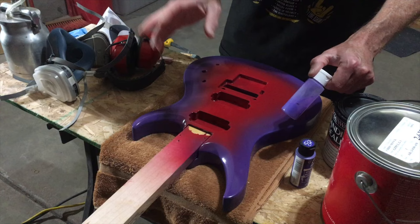Now, with Target Coatings EM6000, you can add a cross-linker that they sell, which basically turns it into a pre-cat lacquer so that it will cure more thoroughly and much harder and is much more resistant to scuffs, scratches and chemicals. But this stuff comes already pre-mixed and is ready to go. And price-wise, I was really surprised at how affordable it is. So definitely, I think this is going to probably become my go-to clear coat finish.